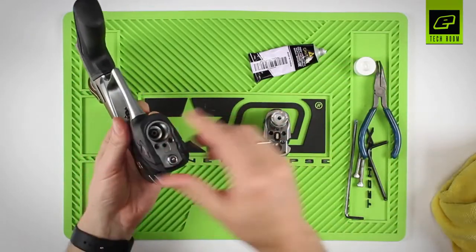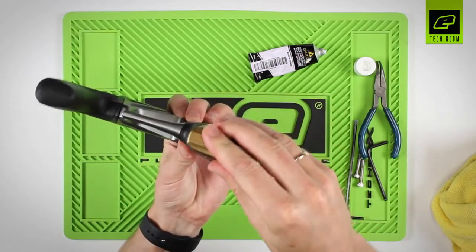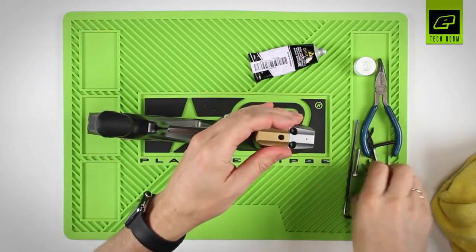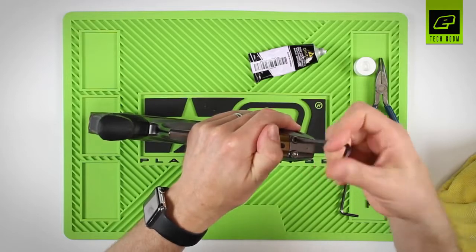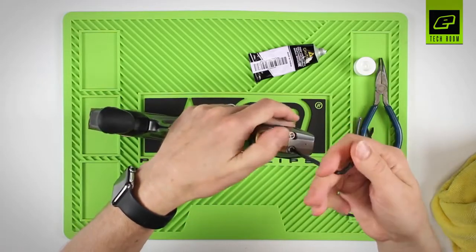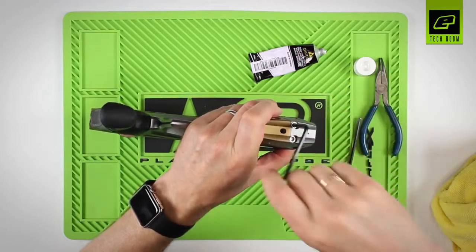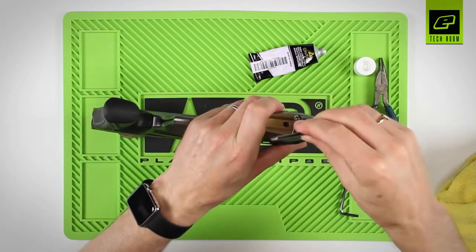This is all the maintenance you should need to do on a regular basis. The spring can be inserted back inside there. Take your POPs assembly and slide that back in. Make sure that the spring locates inside the adjuster assembly. Insert both of the screws and tighten the POPs assembly back down onto the frame. The POPs assembly is under some tension at this point as it's compressing the regulator spring, so once you've tightened one screw up, go back to the other one. Make sure that one's tightened up and double check both side by side to make sure they're both snug.